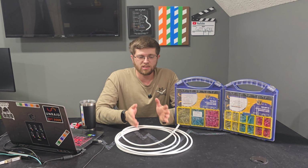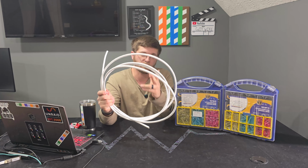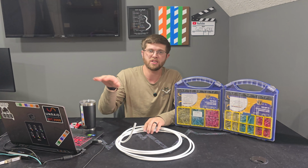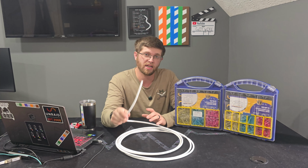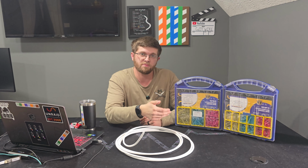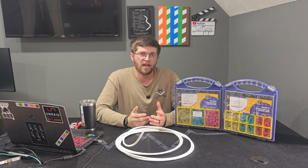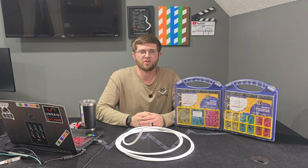So you can get this to work in a pinch, but in the real world, if something happens, like a wire gets cut in two, you want to replace the whole wire. But this will get you by in a pinch if you absolutely need it back up quick. And these butt connectors and crimping tool, and it also has heat shrink, will keep the connection waterproof, and they'll last for however long you're gonna be at that temporary site.